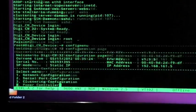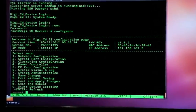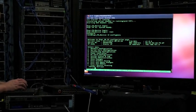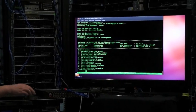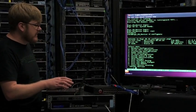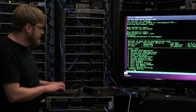The interesting command you want to know is 'config menu'. I'm actually going to leave everything at the default config, but config menu is one way to change the speed and other settings of the serial ports. I'm going to leave everything at the default, which is 9600, 8N1, no flow control. This is also where you configure the network, which we're not going to do today, but you can — it's nice if you have a console server setup. It's a serial port configuration too.